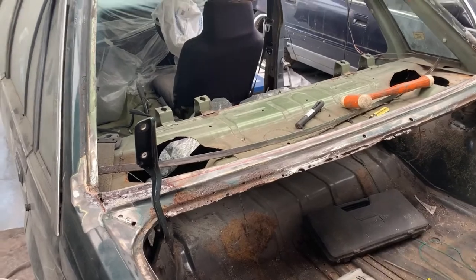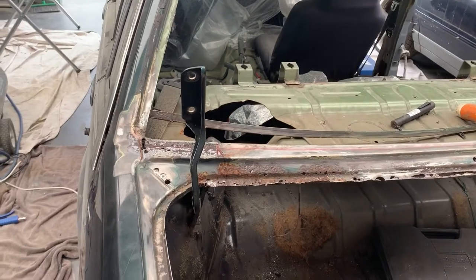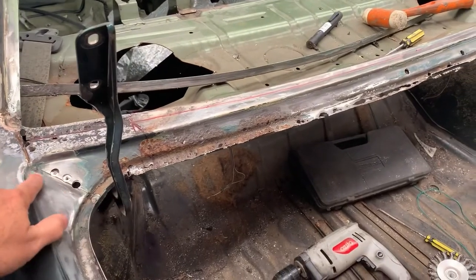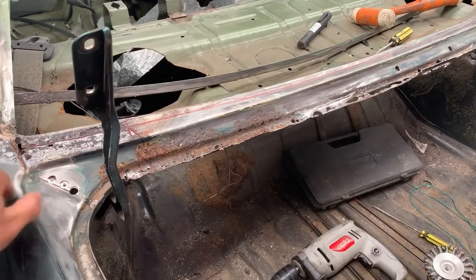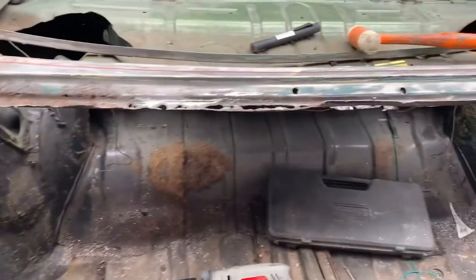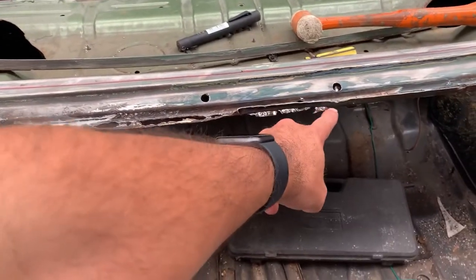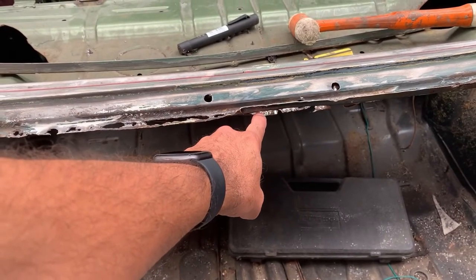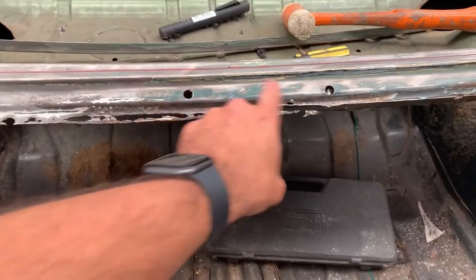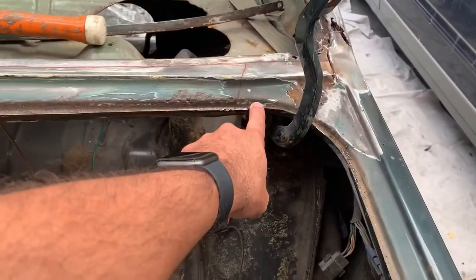And we're back again. So what I've done is I pretty much think I've found all the spot welds that join this together. So you've got both sides through the seams here, and you've got a bracket there that needs to be drilled out, not cut off, sorry. You've got a seam here where your boot light is, then also above there, there's some tabs that need to be done, and then you've got the same on the other side, bracket there and some there.